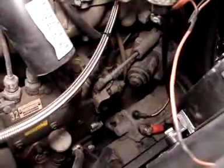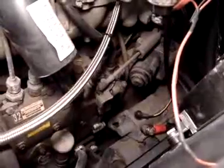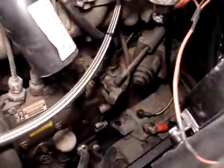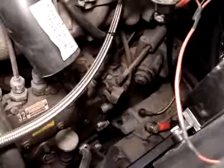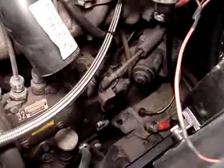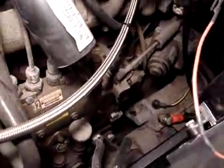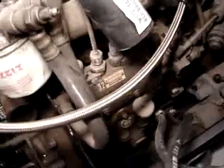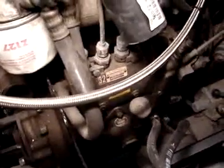That sets basically three different settings. Tell me, Mo, what's going on, what we're seeing there. Right there is the run position, that's crank and start, that's off. So those are three positions that you find to run the EDIC, which is back there — the solenoid in back — and that rod comes up and then helps to run this injector pump, which is kind of over here. The injector pump has the number 32 on it, you can barely see it there.